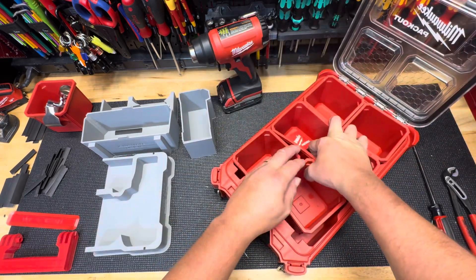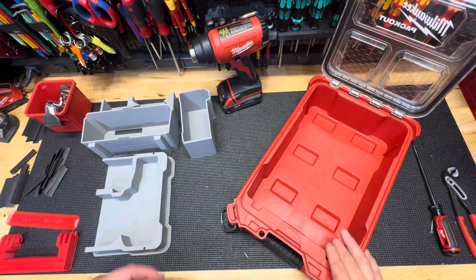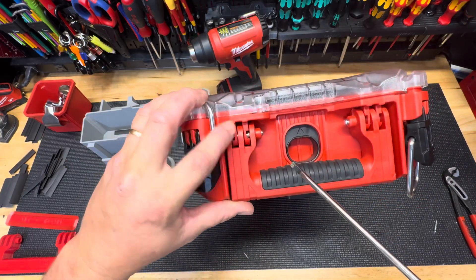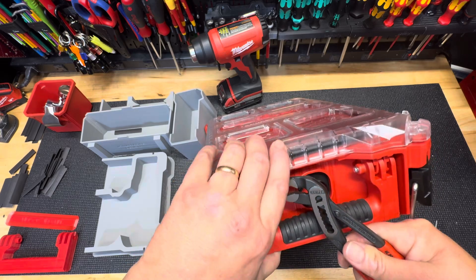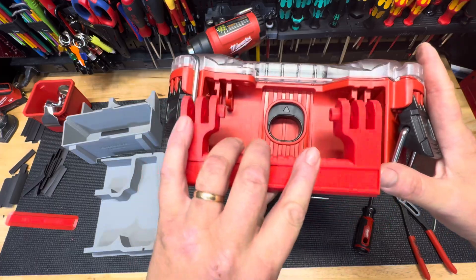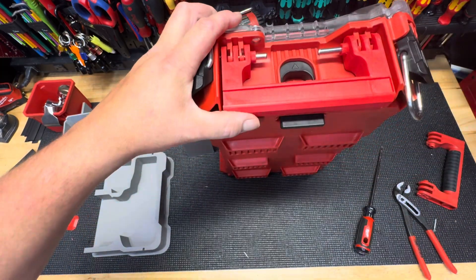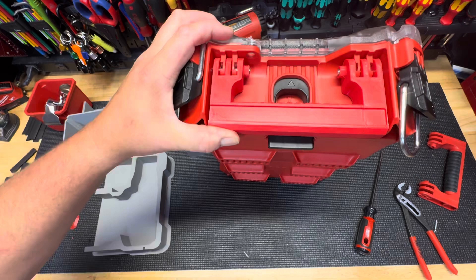I'll take it out. These boxes I get rid of — I keep them, use them for things, whatever you want to do with them. Now I've got my plain packout. I also, personally, I changed out my handle. All you do is wedge a little screwdriver in the corner there — if you look right here, there's a little nut in there. All you've got to do is just wedge a screwdriver behind there and pry it forward a little bit. It's going to pop out that nut and then you just pull it right out. Then I get my 3D printed one and I put it in, and then I'll put my little nuts back in there. Sometimes you just use a little tap-tap to make life a bit easier. All right, that guy's in there.